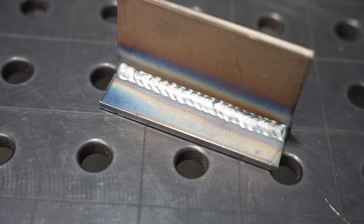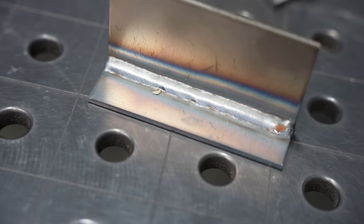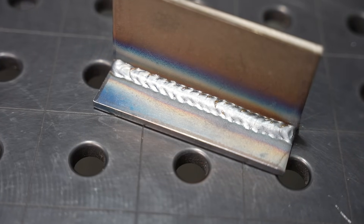The key to a rippled pattern is turning your settings down just a little bit lower than you'd normally run for the plate you're on, and then making a larger manipulation of the weld gun. By doing this consistently like a robot and maintaining those same variables — your stick-out, angle, and positioning — you're going to have a consistent weld with that rippled appearance. I tend to favor the smooth stringer bead over the rippled appearance, but who am I to say what works better for someone else — if it's strong enough and you like the looks of it, that's just fine too.